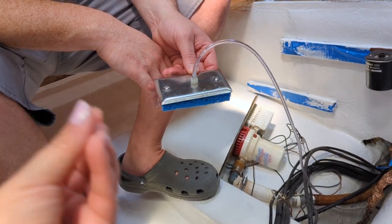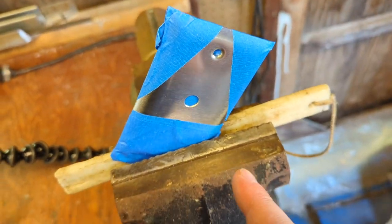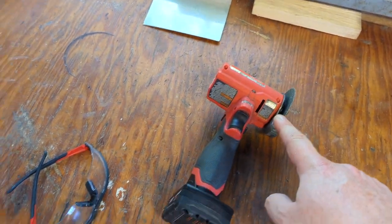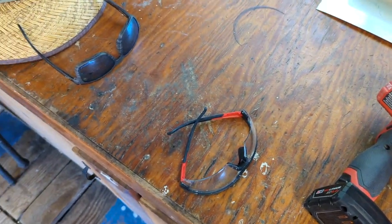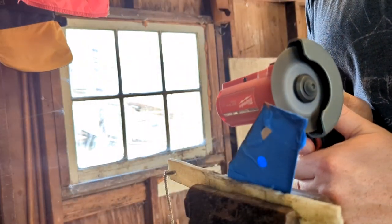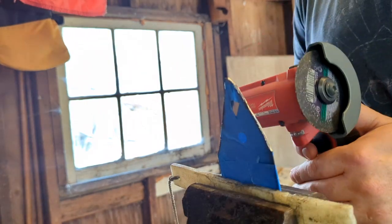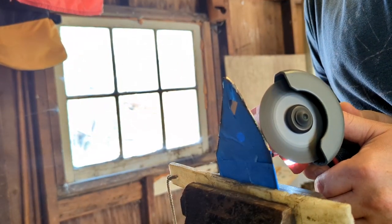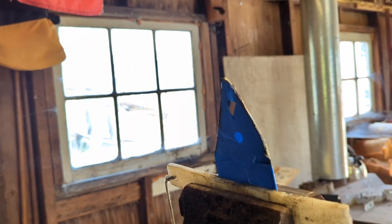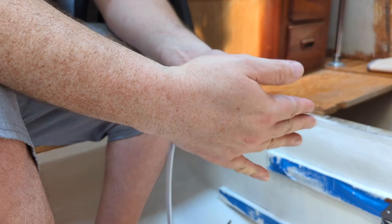It's hitting the keel bolt, so it has to sit flat. I've got the plate in the vise, marked it with tape where I'm going to cut it, and with my cutting wheel and safety precautions — everything clamped in the vise — I'm going to cut it out. Nip the tip, and now this will slide into the bilge.